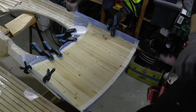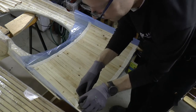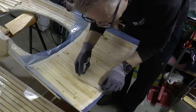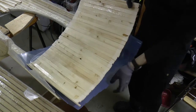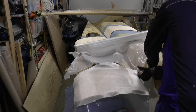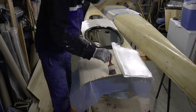The day after, I can remove the clamps. And the masking tape. This looks usable. I fill the gaps from this side as well with somewhat thickened epoxy. After sanding and trimming the surface, I cut out the glass. Saturate the surface with thin epoxy and then with thickened epoxy